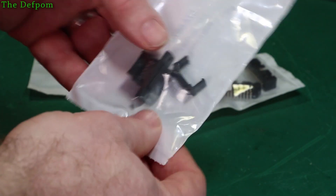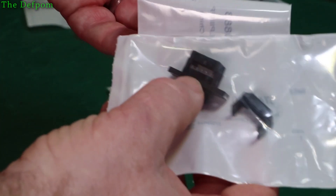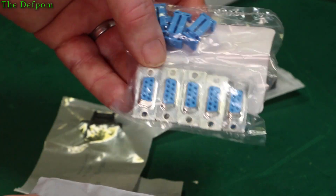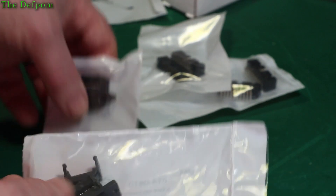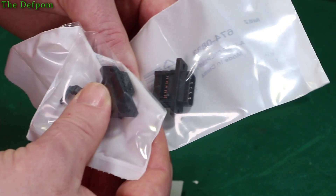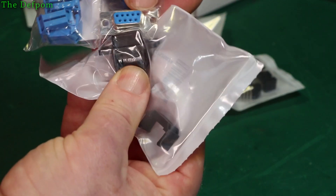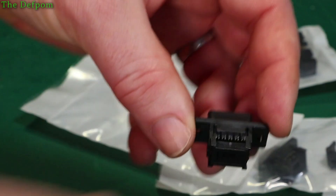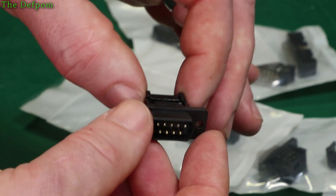And what are these ones? These are some female D9s — great, so I've got ones which actually match. I've got these pairs which came with this set, so I've got male and female. These other ones I've got because I wasn't quite sure what I was going to use in the end — because these have got mounting brackets on them for alignment. I may still use these because of the alignment, but then this has got pins as well, so it depends on where the pins sit. It's got locating pins inside the unit this has got to plug into. So if these don't fit then I'll probably have to use these ones — but they might be standard spacing. They do look about the same, so if the holes are the same size then that's alright. Options — I like options. So it's just an IDC type connector, you just put a ribbon cable through there and squash it shut and it pierces the cables and gives you connections.